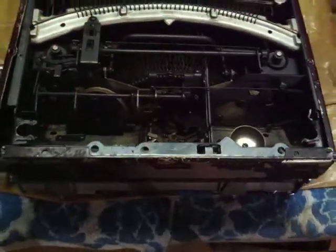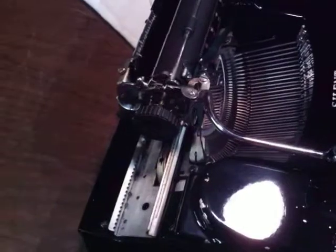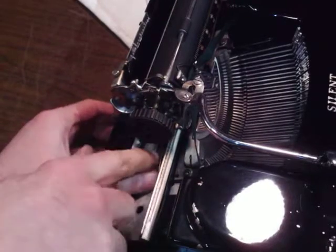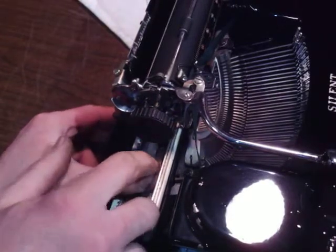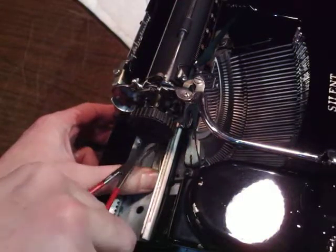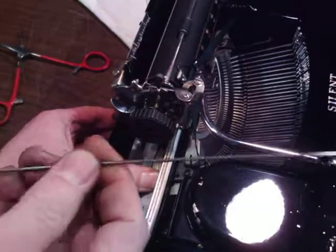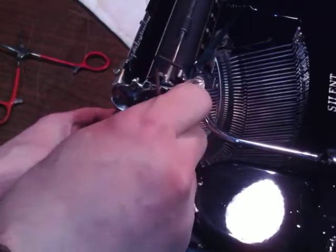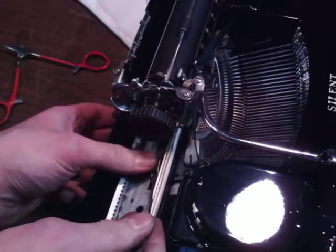So you can skewer it. If you've got a good drawband, this applies. If yours is broke, you won't get to use this trick, unfortunately. What I'm going to do is turn it that way a little bit to get the drawband out, and I'm going to hold the mainspring, which is nice and oily at the moment. I'll grab it out of there quick — there's a knot in it, of course. Now I'm going to stick something — I got this rod — you want something stiff — and you go through that hole, right through the outer ring, and bring it back slow, and that'll pin it in place.